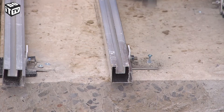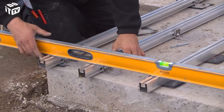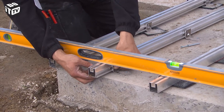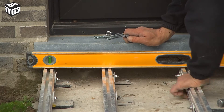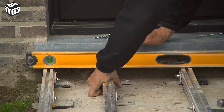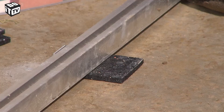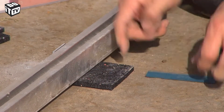Once all the beams have been mounted into the concrete, you can level them by using a long rail, or even better, use a level. Put the beams at the beginning and at the end on one line and then fix the brackets. Then you have to place a rubber pad under the beams — this will dampen the noise from the alloy on the concrete. In some areas the concrete will not be even and a glazing block will have to be added.